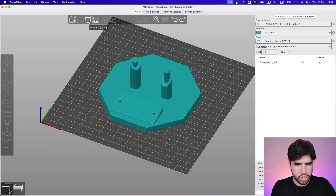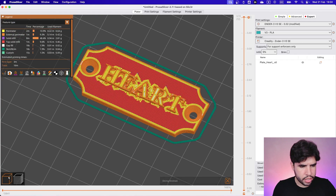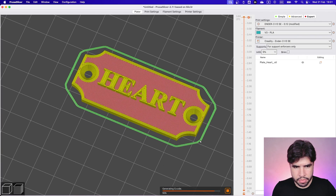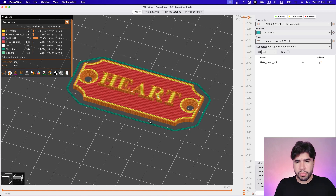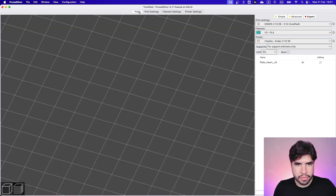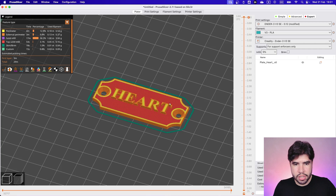Let's go to the other part of the base — the sign piece. Let's slice it and see if those parameters work. We have a small issue — let me check if we can reduce the layer height here. Just 30 minutes, that's more than enough. Another recommendation for these letters is to change the perimeters generator to the Arachne pattern, then resize it, because this is going to improve some thin parts on the letters. I recommend changing this just for this part of your print.